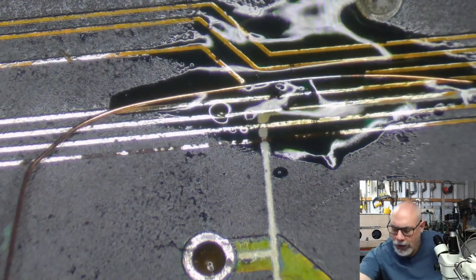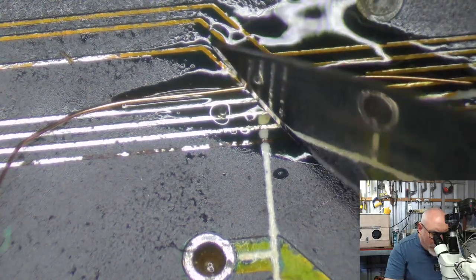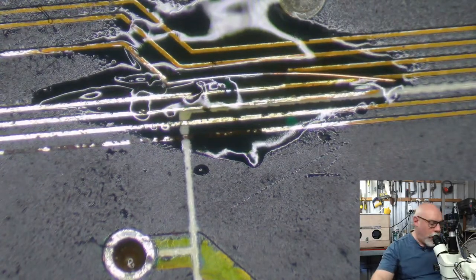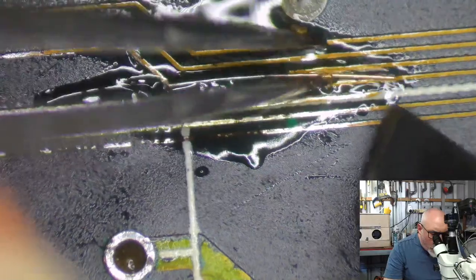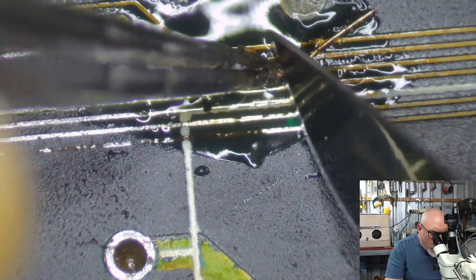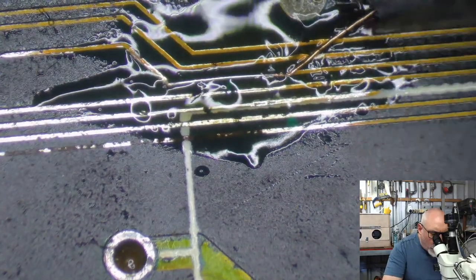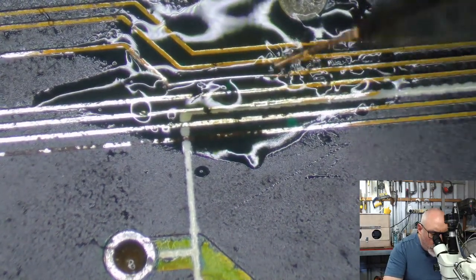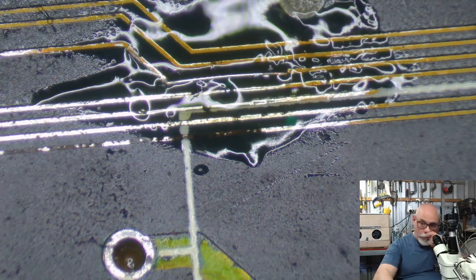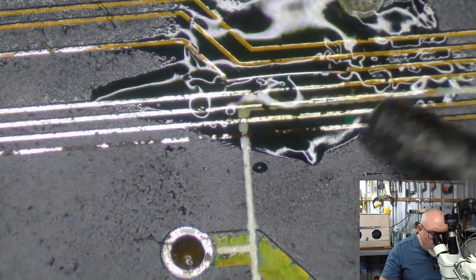Okay, there's a trace repair done. Now, one person on one of my channels said, "Oh, I don't like the way you cut wire off, because you potentially damage the traces." And look, I'm using a microscope here, and you're right, there is probably a chance of that. What you can do is a light little nick like this with this thicker wire without actually pushing all the way down. Then you can grab the end of the wire and give it a little bit of backwards and forwards, and it just breaks off by itself. So if anyone is concerned about using a blade like this and pushing down on that wire and potentially doing some damage, that's a way you can avoid any problems.